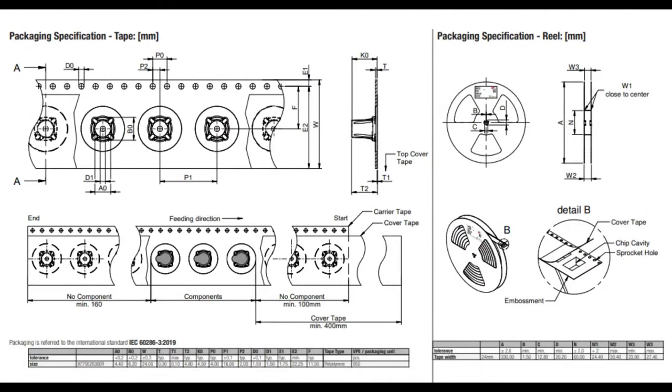They also all come on pick-and-place reel, so there's no separate through-hole assembly step. This is done as part of your SMT pick-and-place line. You load them in — they have a little plastic tape on top for pickup — place them down, and they get reflowed through the reflow oven. The solder mounts and holds in place. When you do your final assembly, all the standoffs are permanently attached in a way that makes it very easy to line everything up without worrying about standoffs slipping out.